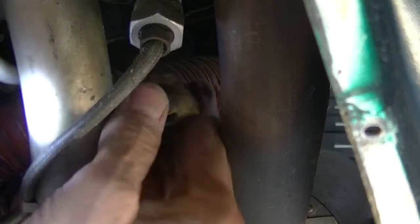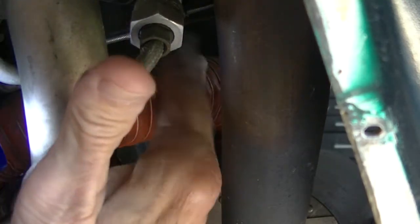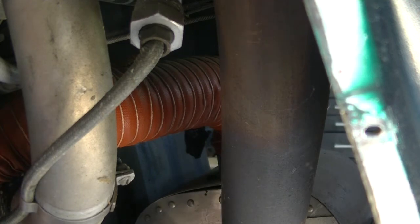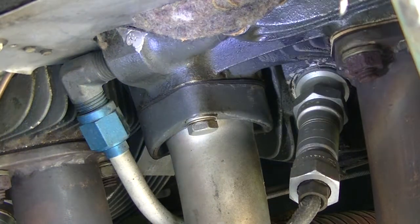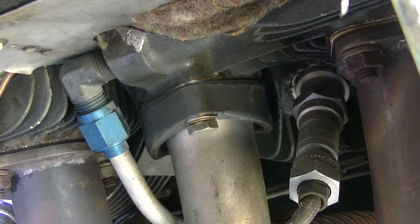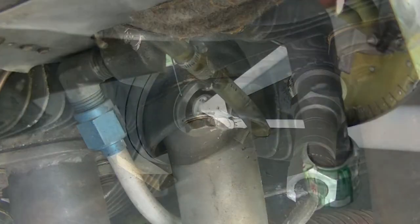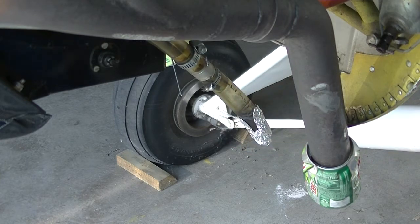Look at that boys — and it hasn't been that long since I had that cowling off and changed the oil. It's amazing, those dirt daubers — they are industrious little pests. Intakes all look good. No signs of any leaks on the intake or the exhaust, no cracks that I can see. Dirt dauber residual dirt here, there, and yonder. I guess I should probably recap my breather tube to keep those doggone dirt daubers out of the crankcase breather.